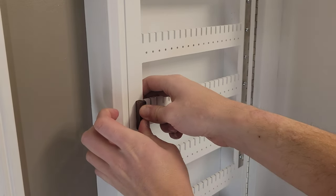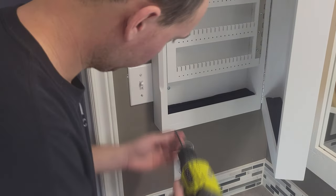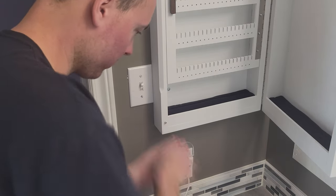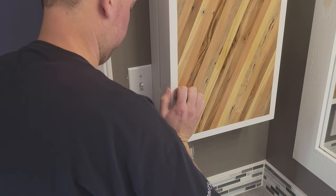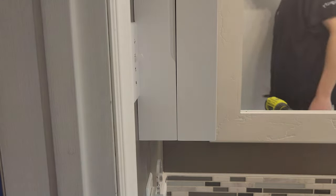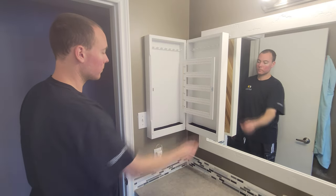The last thing to attach was two small magnets into the bottom corner to keep the door shut. I drilled a slightly small hole and with both magnets attached placed it into the hole and used the door to hammer it in place. This left an imprint on the door which I could then drill out for the other side. And with that magnet the project is complete and ready for the birthday girl to load up with all her treasures.